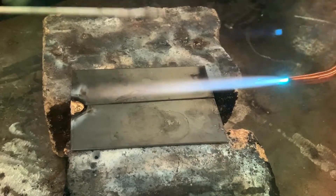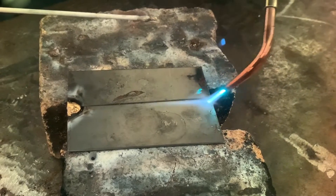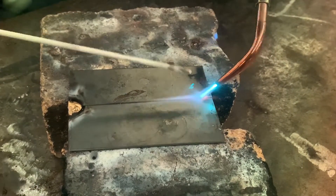When you're brazing on this joint, make sure of course we have a slightly oxidizing flame, and we're going to do a zigzag or a circle motion. We're going to hit both pieces while we're adding the filler rod.